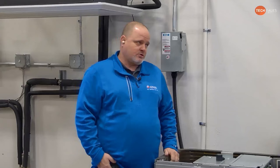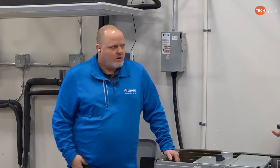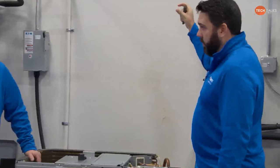So yeah, I can't tell you how many times I've had that conversation with a contractor on the phone, because they don't understand the difference between discharge temperature and condensing temperature. Right, because generally speaking, you're thinking high temperature equals high pressure because of the pressure-temperature relationship. I've learned over the years of being a TSA that you've got to rein them back in so they get a better understanding of what that thermistor is actually reading.